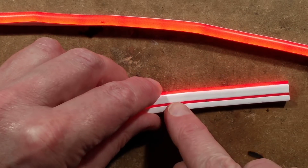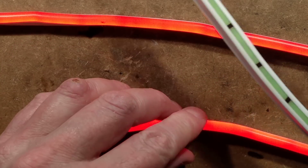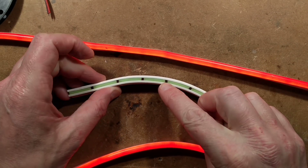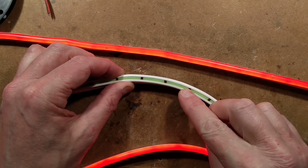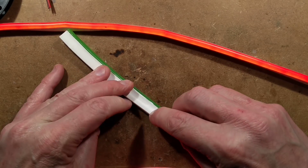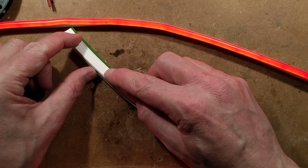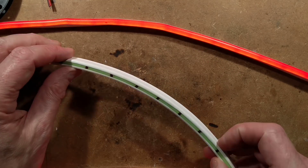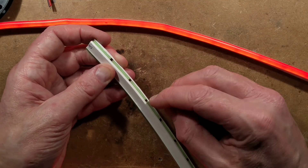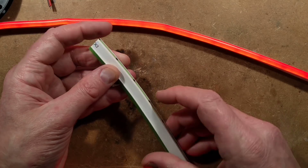Let's explore how to cut it and investigate the little window on the side. Whereas previous manufacturing techniques had marks that had to be transferred from the inside, there's another version which has one mark every metre and they line it up, then print little dots on the outside at every 25 millimetre spacing, synchronising the internal dot to the external dot - that's where you can cut. If you cut anywhere that's not on one of these marks, it will kill that section of LEDs and break its circuit; the rest will work fine but that section won't.